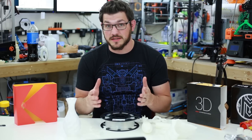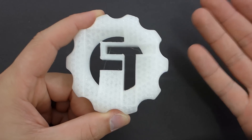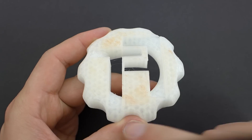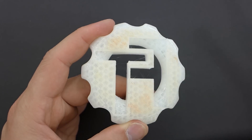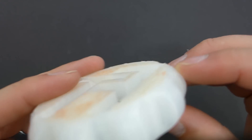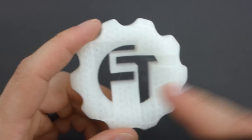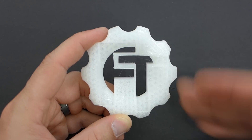Let's take a closer look at the prints and see how they turned out. First up, my MakerCoin — this came out really, really nice. Super smooth. I can't get over how smooth nylon actually is when it's printed correctly. The support went on really well. The overhangs went really, really well. There's one that was a little rough, but the rest are smooth with no real issues. There's a little bit of stringing in there — just a few — but overall this was a very successful print, and that was at 260 degrees, not the recommended 225.